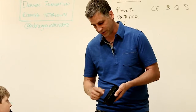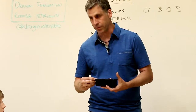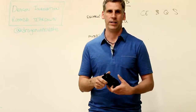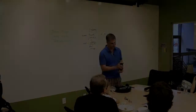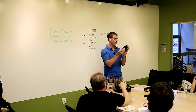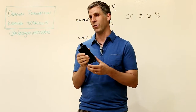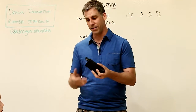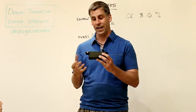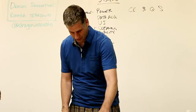New batteries have a bunch more screws and are ultrasonically welded. We used a thermistor to measure temperature, so if it got too hot we'd know something was wrong. And there's also a PTC, which is basically a resettable fuse. One of the things that haunted us is these flimsy little catches: Elliot designed them in a weekend and they stuck with us for three or four years. If you drop the robot, the battery will fall out - it's a lousy design. Just thinking through those things carefully because they may stick with you for a while.